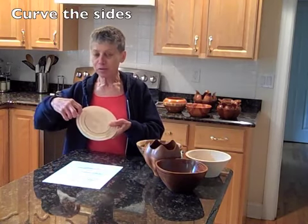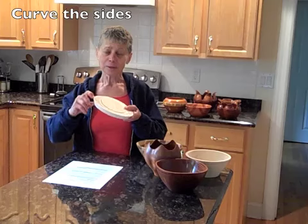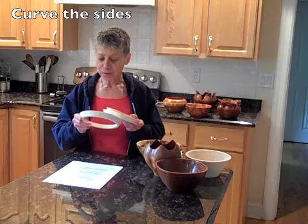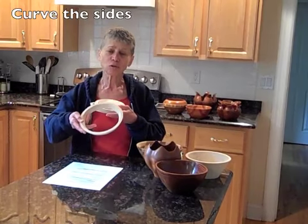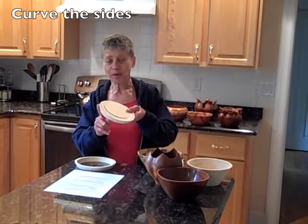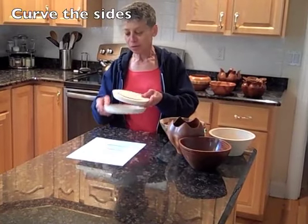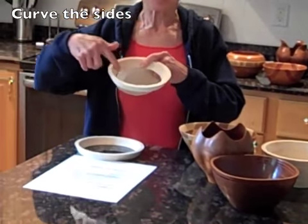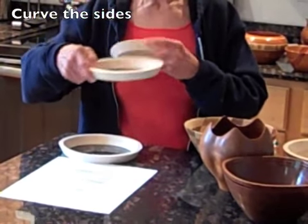This is your typical 3/8 inch wide ring, 3/4 inch thick wood that takes a 27 or 28 degree angle. Well, on this one, I cut the first ring as you would typically, 28 degrees on the outside, build my entry hole, 28 degrees on the inside. Now my next ring is already 28 degrees on the outside because that's the way it came off of the first ring. But now instead of cutting the inside at 28 degrees, I drill and cut it at 35 degrees.